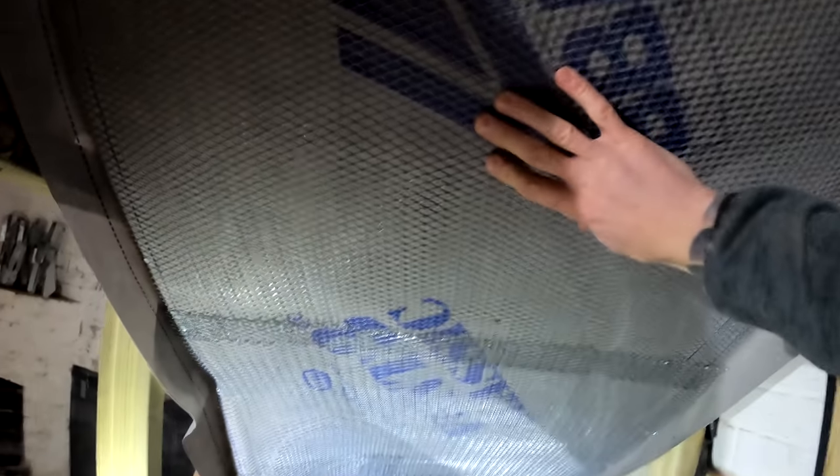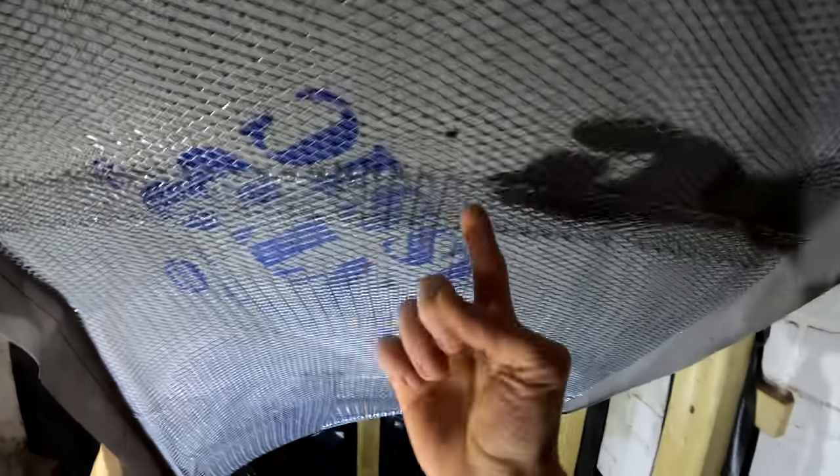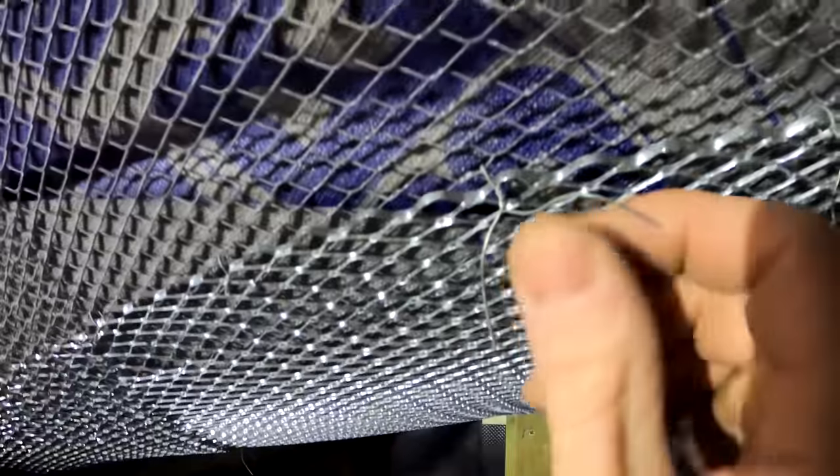So you can see what I'm talking about now. I've got my roofing felt underneath my plasterer's lath here. It's all pinned down the sides, and I have managed to get some tiny little screws into the bottom of the tread, the underside, just to hold the middles in. Then what you need to do is just use some wire - you can see down here - so you just get some wire in between, hook it round, twist it tight, and that holds this all nicely in. So you can see now it's starting to form the shape really well in here.